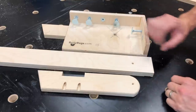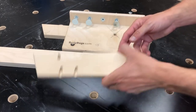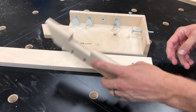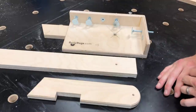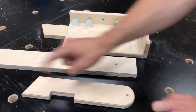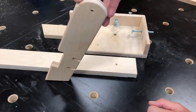The jig has a couple of reference distances to ensure we put that hole in the right spot. As we spoke about earlier, we want that hole to be centered, so whether I'm making a right leg or a left leg, that hole is in the same spot — it's going to fit every single frame whether it's a right or a left. The hole also needs to be the right distance from the ground. You're going to reference off of the foot of the leg, so the leg hole puts the bolt in the same position and your board is the right height off the ground.